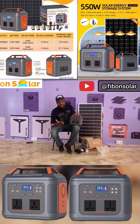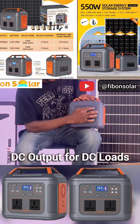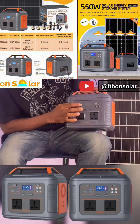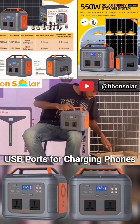This is where you connect your load — your home appliances such as your TV sets, standing fan, or whatever you use at home. These are the DC output ports — there are about four DC outputs here where you can connect your DC bulbs or DC fan. These ones here are your USB ports.